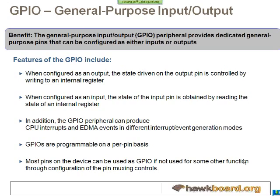For GPIOs, all of the pins on the device that are regular digital IOs — that are not special USB or SATA pins — can also be configured as GPIOs. These GPIOs can be configured on a pin-by-pin basis. We'll talk about pin muxing shortly, but basically if you're not using a particular peripheral, you can change them on a pin-by-pin basis to be a GPIO for other functions.